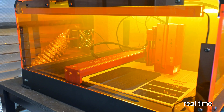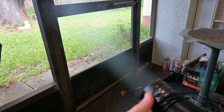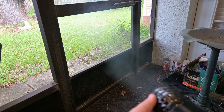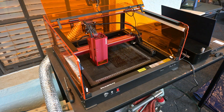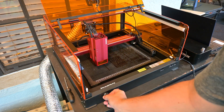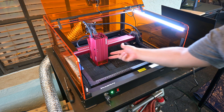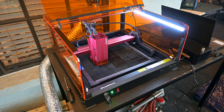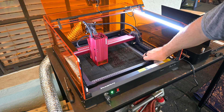You'll definitely want to vent outside or through an air purifier, because when cutting at full power in 48-watt mode, the A48 Ultra can exhaust a large amount of smoke. You may have noticed that there is no bottom to the enclosure — the A48 Ultra does not include any kind of work surface. You'll need to purchase a honeycomb panel separately or add on Atomstack's H2 riser or conveyor feeder. I was using a 300mm by 300mm honeycomb panel with no issues.